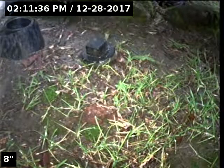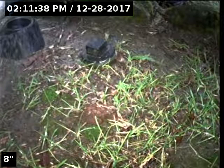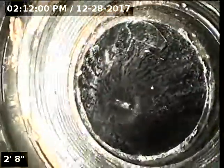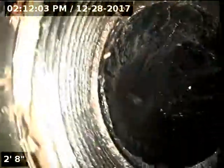I'm here on the southeast side of the house, actually the east corner of the house back where I've located a 3-inch ABS cleanout. So there's your backyard there with your deck. Here's the corner of your house and here's where I've located the cleanout. I have water running from the kitchen sink. The water is running downstream towards the southeast. There's houses on every side and a church parking lot to the southwest area. I'm going to go ahead and scope the line from here.